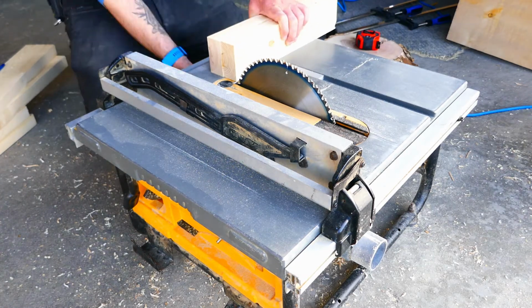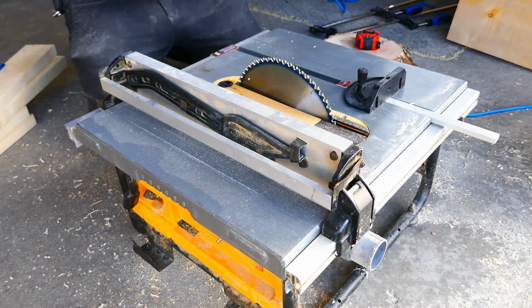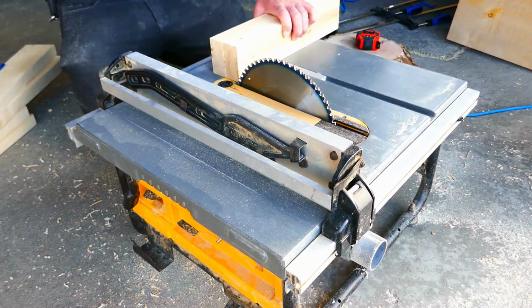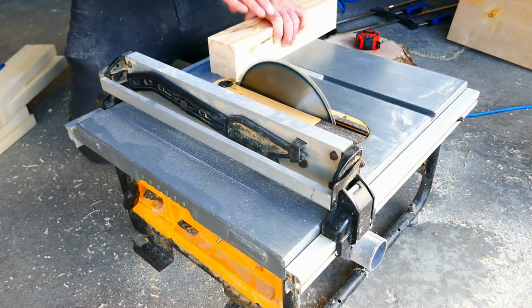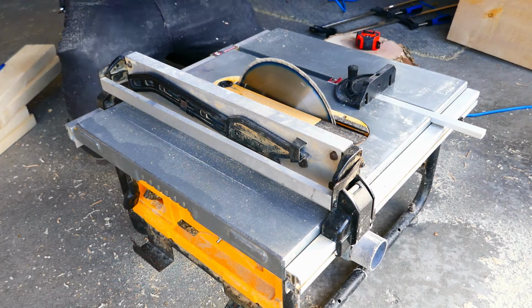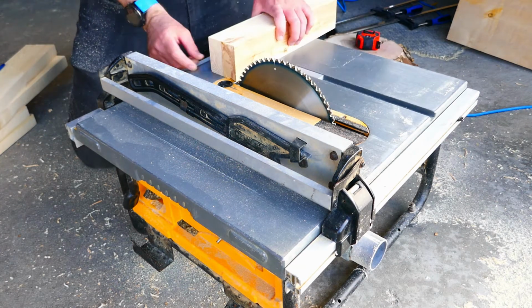Normally, to make all the legs the same length, I'd clamp them all together and grind them down with the belt sander. Yes, I'm fully aware that that's not the most effective method, but hey, I'm still new to the game. As I had the table saw out for the grooves, I was wondering if I could use it to make all the legs the same length.